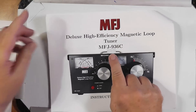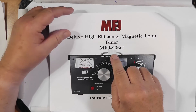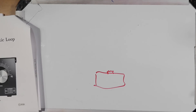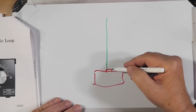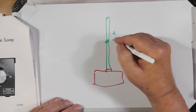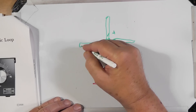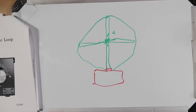On top of the tuner there's a little receptacle for a piece of plastic pipe. You can place the tuner down here with the plastic pipe receptacle, and then run a piece of plastic pipe upward. You can get one of these four-element spreader pieces so the arms go down, up, out, and out — and you wrap your loop wire around those arms.